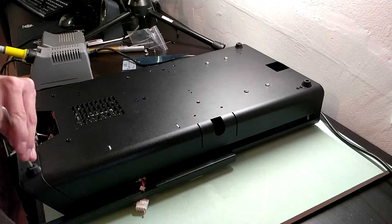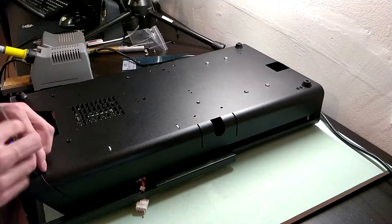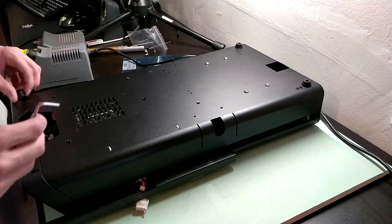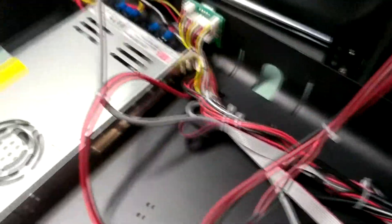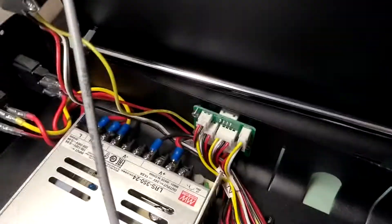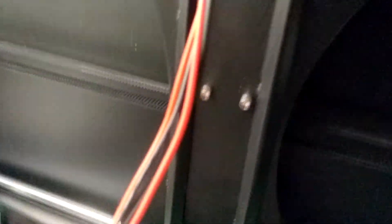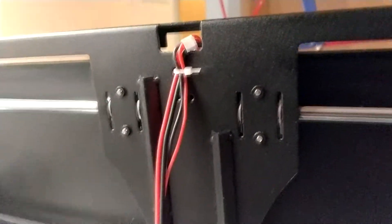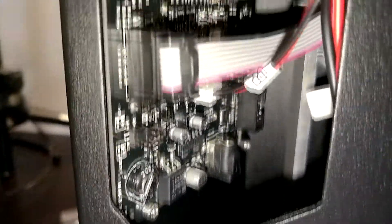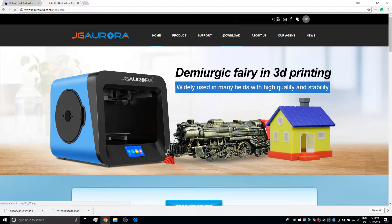With the heated bed still disassembled, I took a look at the insides. The cover is screwed onto the base by 3 screws in the back and 2 inner feet in the front. I have to point out that this case is well wired — all long wires are looped and no wire is hitting anything. To my surprise, I realized that the PSU outputs 24V instead of the usual 12V, which allows thinner cables to the heated bed. The controller is a MakerBase board which supports up to 2 extruders. The touch screen module has a hidden SD slot and the software running on it is Marlin — you can download the correct files from the website.